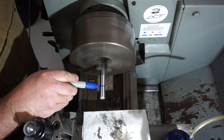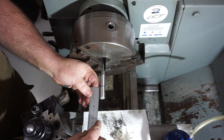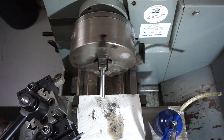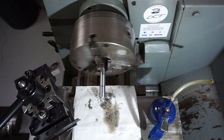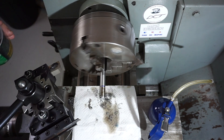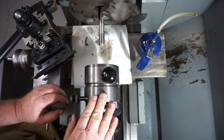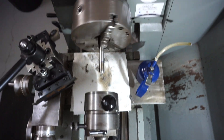I've had to switch over to the bigger Coventry die — this is the one-inch Coventry die, Alfred Herbert. The reason I did that is because I had some chasers for my three-quarter inch Coventry die, but they had missing teeth. There were probably three sets of chasers in there and every one of them had a chipped tooth, or some guy had got on the grinder and ground them off. So I found another packet of dies that suit the one-inch head and swapped it out. You can see here I'll give this one-inch head a try.